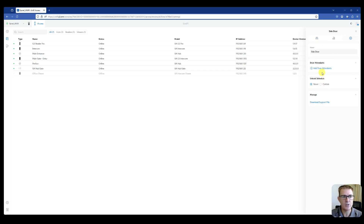Hopefully that answers a few questions. As you can see, you can change the attendants if you just want to use the hub on its own with the Access and Identity apps to manage doors independently. If you add an intercom the caveat is you need one access reader or intercom per gate if you want users to independently enter a pin code without using the app. Hopefully that's been useful — head over to our YouTube channel for plenty more how-to guides and box openings. Subscribe and stay up to date.